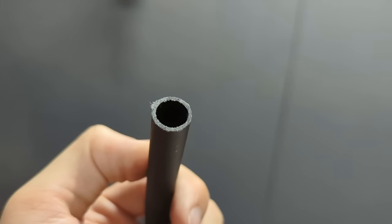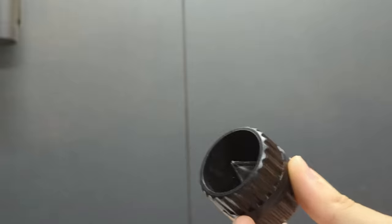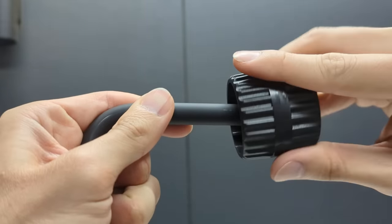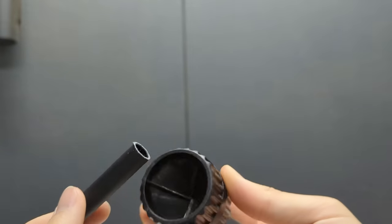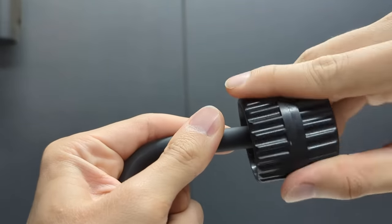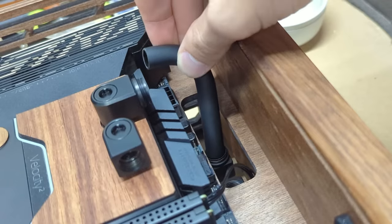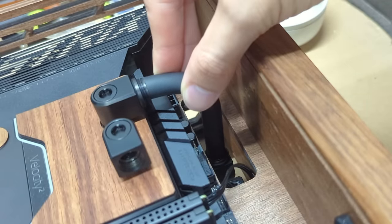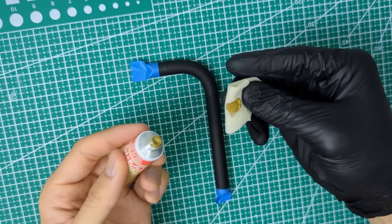The saw leaves a rough edge, which is smoothed over using this deburring tool. The tool has two ends that deburr the inner and outer edge of the tubing. We need a smooth edge on the tube to prevent damage to the O-ring seals. After test fitting each tubing length, I coated them in gold Rub 'n Buff and set those aside to dry.